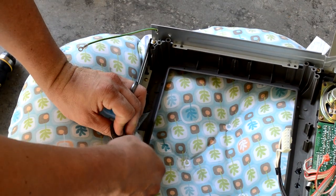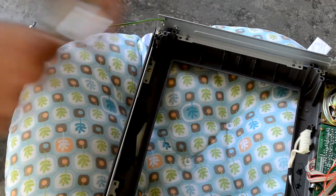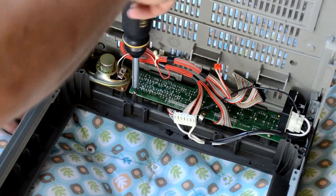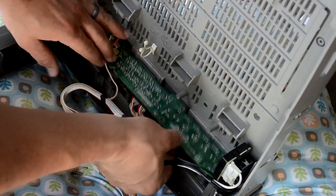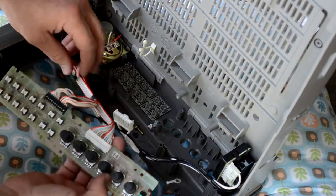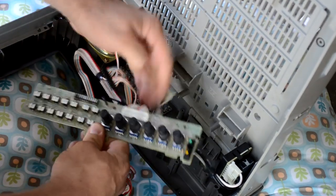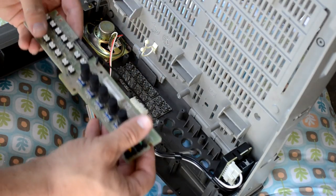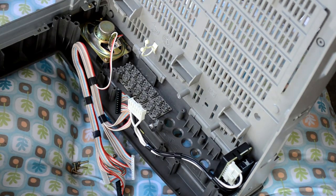The 1350 does not support a tally light, so I'm going to remove the light as well as the cabling. Then I need to get the control board out of the way — this is the button control board on the front with the knobs for volume, etc. It's held in place with just some Phillips head screws. I'm going to leave the speaker and the power-on button inside the bezel, as they are the exact same OEM parts from Sony in both monitors.